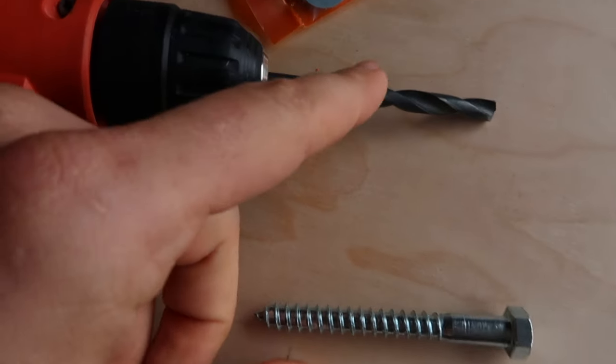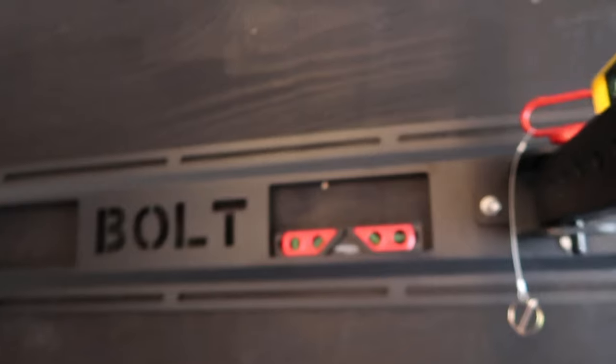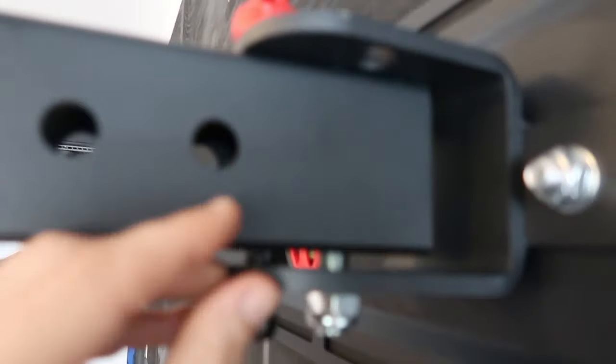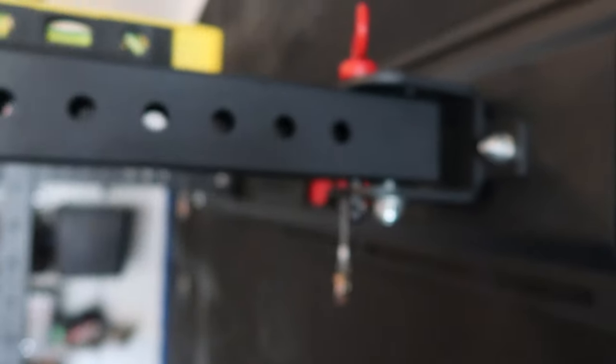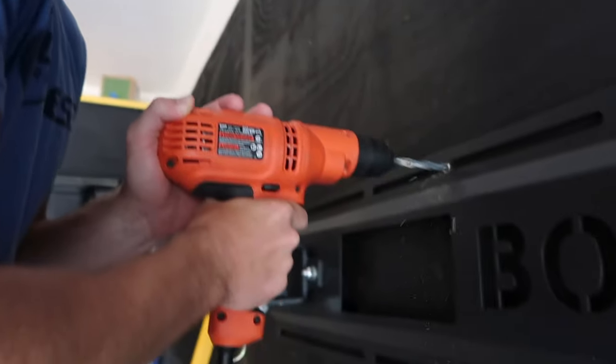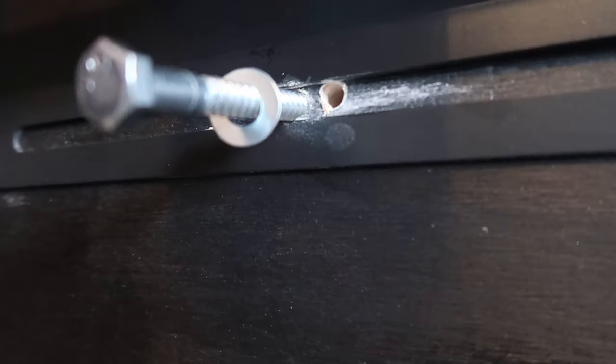This is a three-eighths lag bolt with a five-sixteenth drill bit — we're going to pre-drill with that and use a washer. We'll keep a level on the side piece and the middle one, leveling as we screw it in. We have a little bit of play so you can lift up the arms and fold them in and out. We were over by just that tiny bit and missed the stud. As you're drilling in, you'll feel the bit grabbing into wood, but as soon as it goes into air and gets really easy, that means you missed the stud. Very important that you hit studs, especially when bolting on this stuff because it's holding all your weight. We just bumped over a little bit and hit — we're good to go.